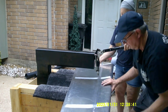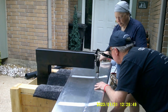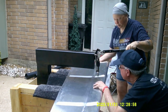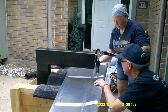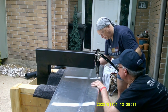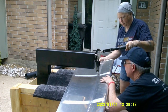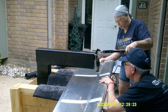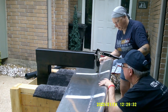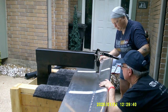There I was pointing to the leading edge - I think there are five or six holes you have to dimple there, but you've got to really bend that aluminum back. At first I was afraid to do that but I don't see any other way to do it, no matter which dimpler we use. We were just really afraid we were going to hurt the skin and cause a problem, but we ended up not. Sometimes she's dimpling and sometimes I'm dimpling - it just depends on who can hold the aluminum in the best position. I was getting down trying to make sure we're getting the die in the exact hole before we push it down.